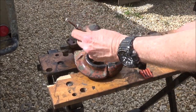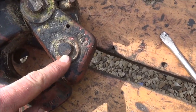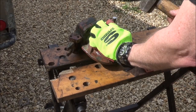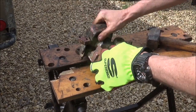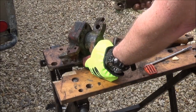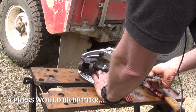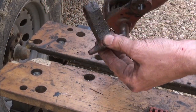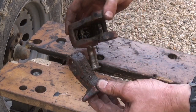We're going to knock the clips out of here which release these pins. We've moved the E-clips out of the way and it's just a case of smashing these now to knock them through, so I'm just going to use this as a drift. I've got glasses on just in case. Once you've got the first pin out you can wiggle it around and take the top bit off. I've resorted to the big guns — using a hydraulic puller now because it is just not pushing through. We've knocked the pin most of the way through but it's not fully through, and that's the locking mechanism. I just need to clean that up now and then we'll put it all back together.